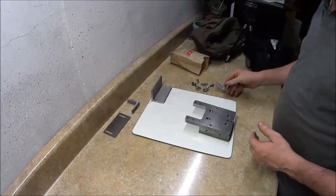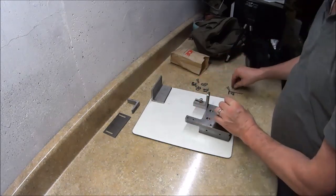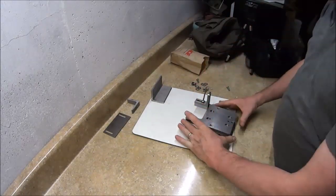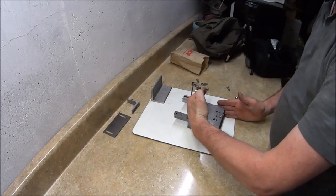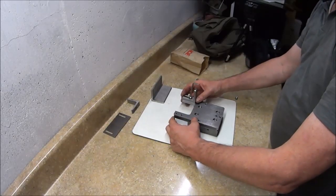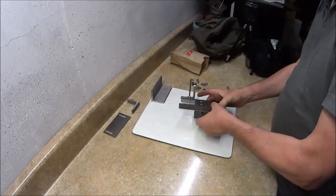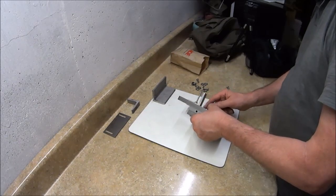Then on the top end, these are what I referred to in the drawing as the fixed angles. These are the ones that you want to make parallel with your platen face. So you get this square with your platen, and this parallel with your platen, and this side's perpendicular to your platen. Then what I do is I put a straight edge across the platen, and these will slide up against that straight edge, and then I can snug them down where I want them. I actually want them to be back here myself. I like to keep them back farther into this opening area, so that the belt will stop out in here and won't be grinding away on the tool.